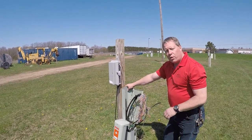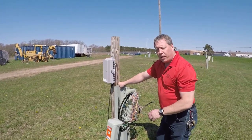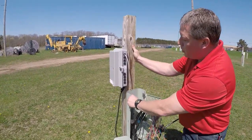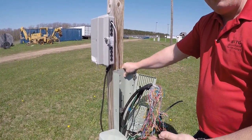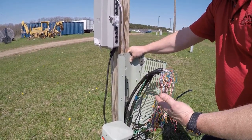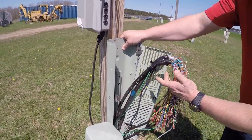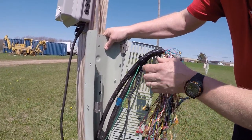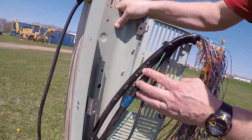In this video we're going to talk about the PED and the underground wiring of twisted pair copper. In this pedestal you can see it is mounted to a post that gives it security and stability due to weather and climates — a lot of snow — so that it doesn't tip over. Inside this PED, the cabling we have in here consists of two P89 cables for underground buried filled cable. As you can see in our other videos, we have markings and so forth. Here's the footage marking.